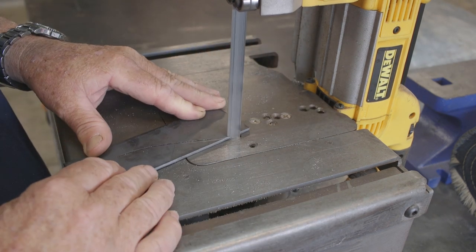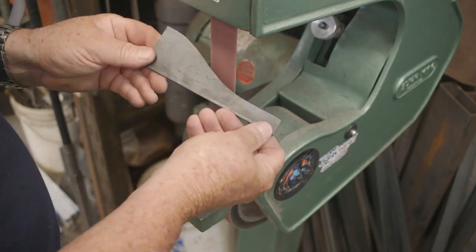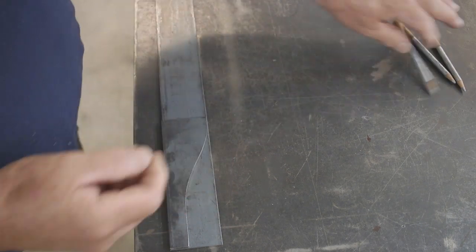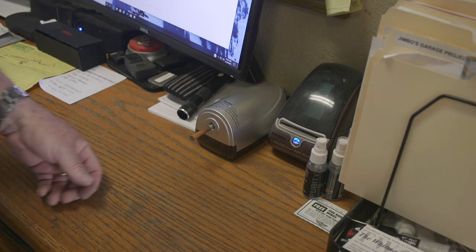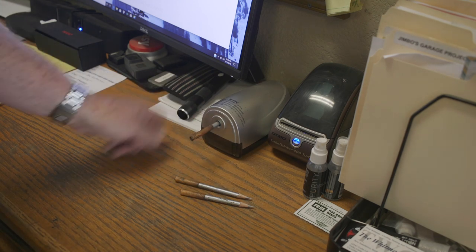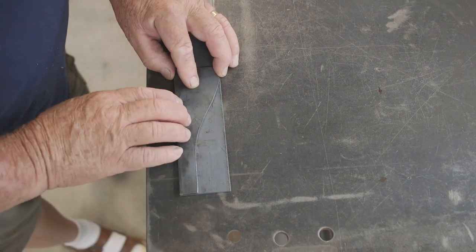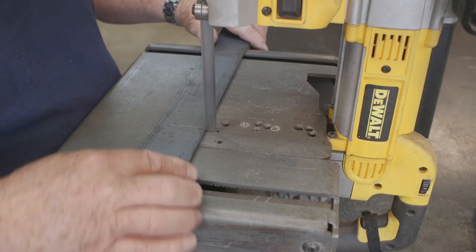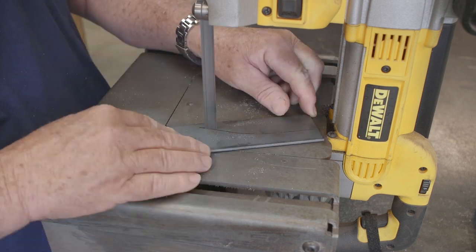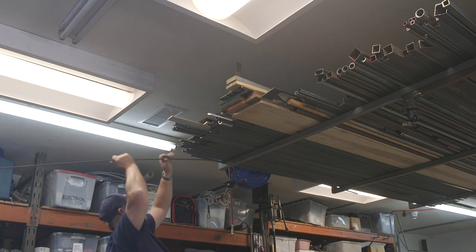Didn't quite have enough room so I had to flip it around to get that side done. Then over to the burr king to deburr everything and get it shaped up. I want to use this piece as the template for the next piece. I love these silver pencils — I'll put a link in the description, I get them on Amazon. Just marking it up and getting it over to the portaband to cut this piece out. It actually worked out pretty good going around that radius — sometimes the blade being thick can't make very sharp radii, but that worked out fine.